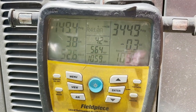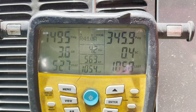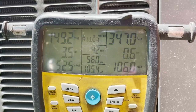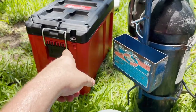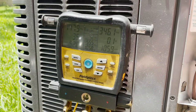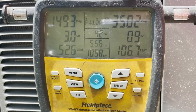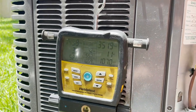That sure does look a lot better. Well, the sub, that expansion valve is playing right now because it's like 83 degrees up there since I had the system down, and it wasn't cooling that well anyway. So I still got a lot to clean up. I got to clean up my nitrogen, my torch, and my vacuum hoses and stuff, the case. So I'm gonna let this run while I clean up and see where it settles at. But we're all ready. We got suction pressure now. We got a little bit of superheat. We got a degree of subcooling. We just gotta let it equalize.